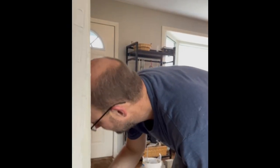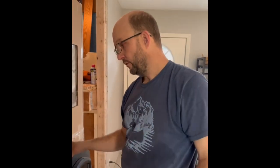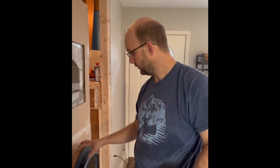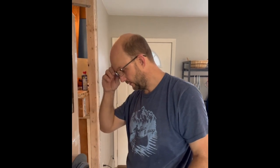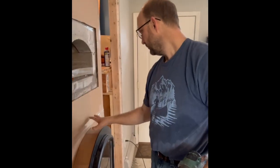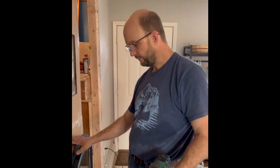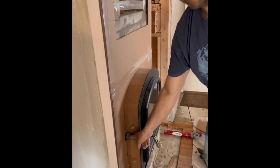Why not? If you permanently attach your fire door to the core and to the exterior skin, which is what these studs do, those two things expand and contract at a very different rate. And so the door and all the brick on the outside is going to start to tear up. This is really helpful for getting this set where you want it, but you can't forget before you start your fire to pull that bolt out of there.